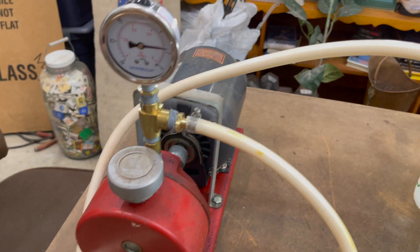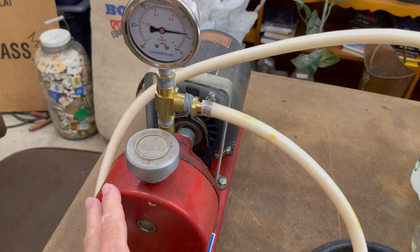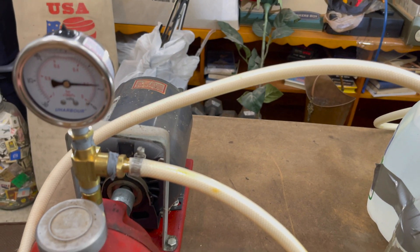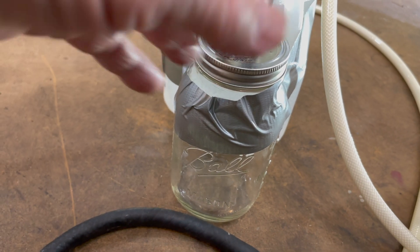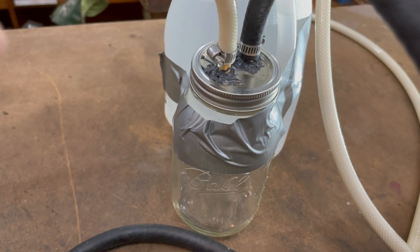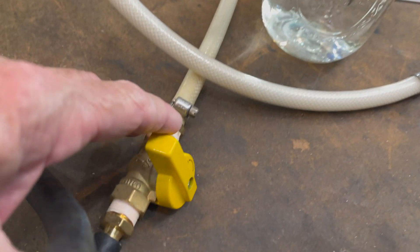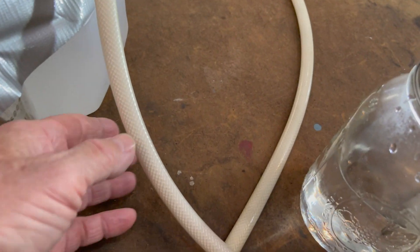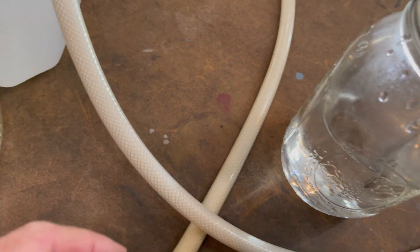This is our experimental apparatus. Got a vane type vacuum pump with oil in it, got a vacuum gauge, got a line coming off of that. Basically a trap — this is to trap any water or anything else to keep it from getting into the pump. Then a hose comes out of that and goes to a gas type shut-off valve. This line here is just shower hose, and it works pretty well for this — 3/8 inch diameter.